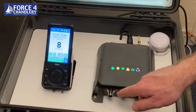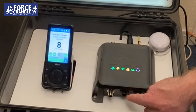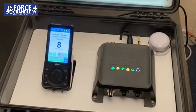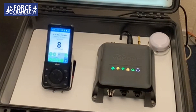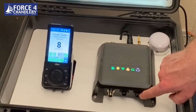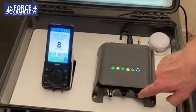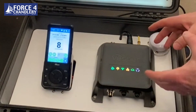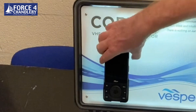On the front we have an NMEA 2000 port and an NMEA 0183 IO port, so you can connect up to third-party external sensors such as a bilge level alarm. You can also control two relay circuits — to turn on a heater remotely, for example. There's also an audio output; the audio from the handsets is plenty loud enough, but if you want an external speaker you can connect it here. The M1 hub can be powered from 12 or 24 volts DC, and all the inputs and outputs are galvanically isolated.